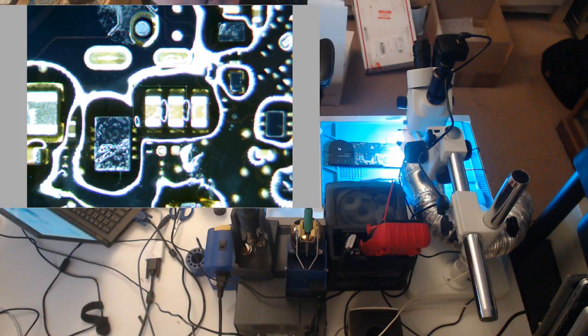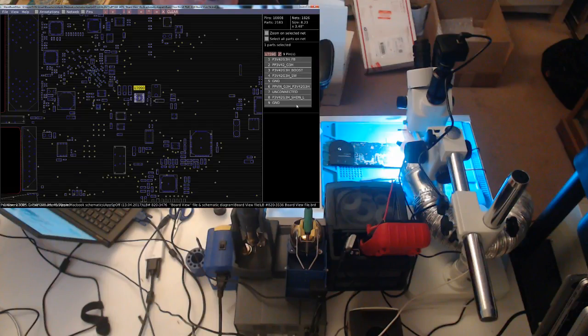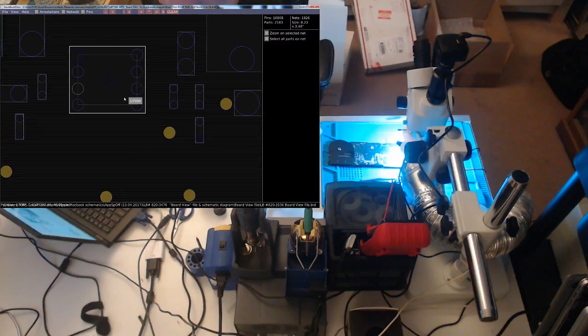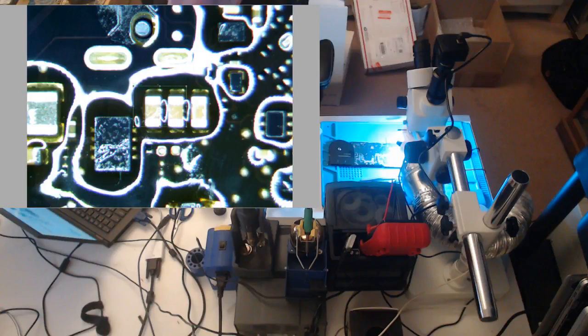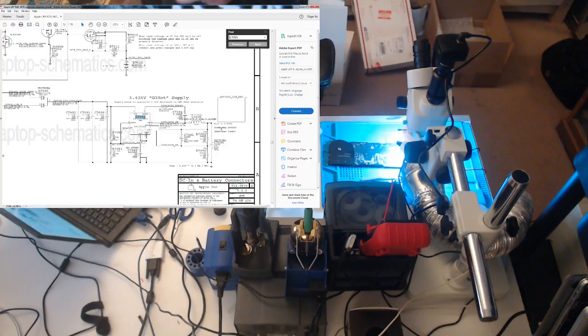let's go over to the schematic or the board view. So let's get our component number here. So here's U7100, right? Our guy that's shorted is right here. Wait a second. That's for PP3V42. Why would that get screwed up? Unless the MagSafe board is bad. No, I don't think so. So we don't have a short anymore. I saw this getting noticeably hot on the, let's see, U7090.